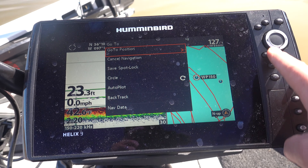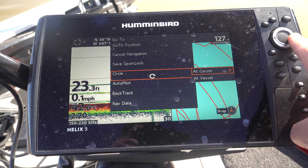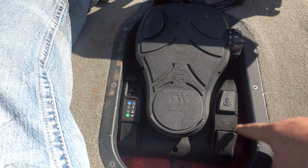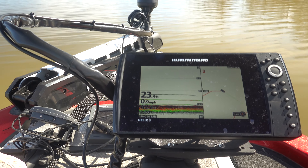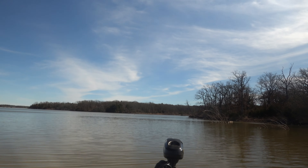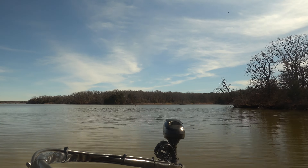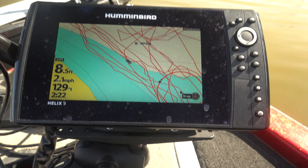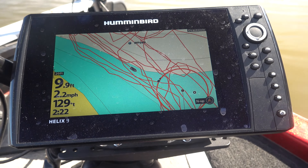So hit "go to," circle — cursor that waypoint. That's where my cursor is on that waypoint way out there. Clockwise is fine. And then from there you hit the go button. So it's taking us to this waypoint way over there. Then you can adjust the speed if you need to. You can see on the depth finder here, it shows that it's approaching that circle, that waypoint, where the 50-foot circle is — it shows we're approaching it.